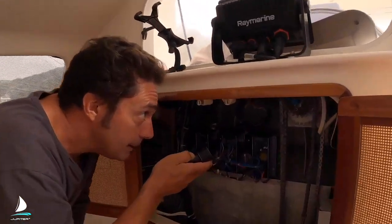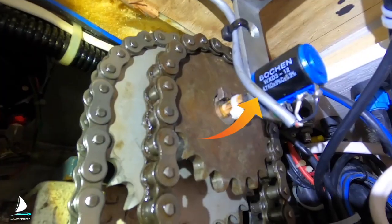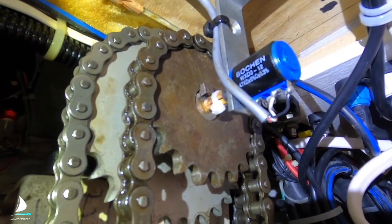Here's a good boat hack for you guys. Raymarine sell autopilot bundles missing the rudder reference sensor - I guess to keep their prices low they cut out some important gear. The manuals thoroughly recommend having a rudder reference sensor, and these cost $240-$250 US each to buy extra. But all that's inside is a potentiometer - a variable resistor. So you go to the electronics shop and buy one for a few dollars. Here I've put one in on the steering axle connected to my steering wheel.